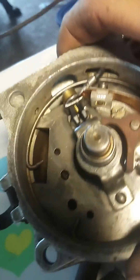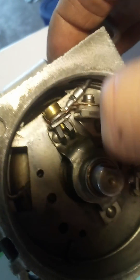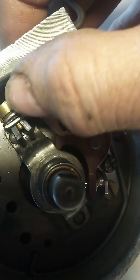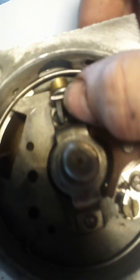It goes so many degrees left and right, and that allows from here to here to move slightly. The problem I found was that that piece of foil was actually down touching this base of metal and grounding. Same thing around these edges on the far side. So you've got to take a small tool and go in there and make sure that it's not touching the body, because it's grounding out.